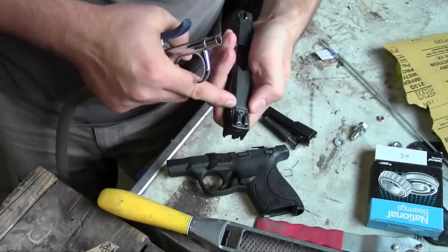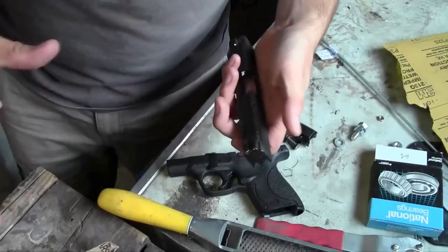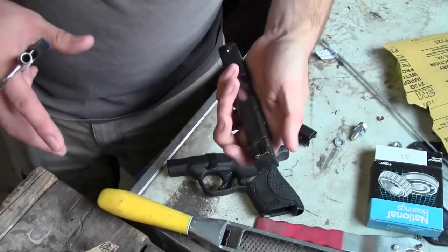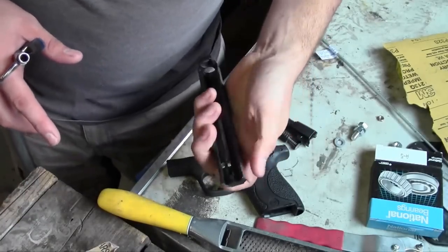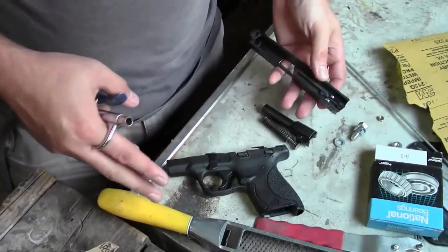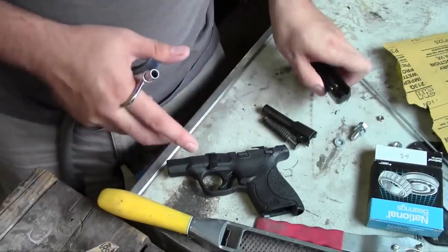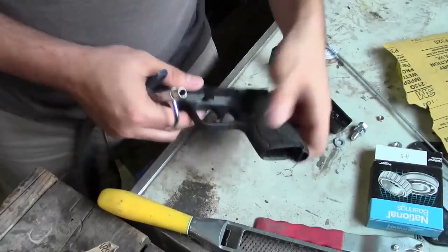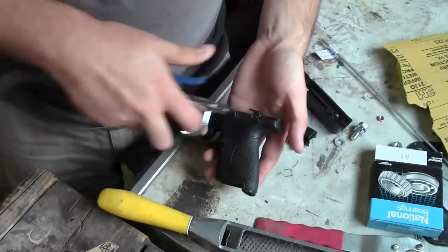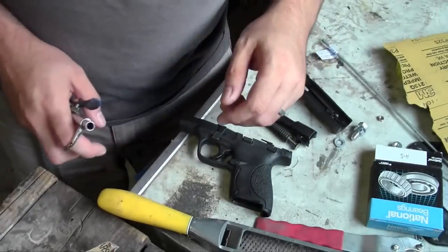If there's a crack, a crevice, or a seam anywhere in any of these parts, blow air into it, the water will come out. And when the water comes out at high speed, it takes dirt with it. And since you just put soap water in here, all of these parts are super duper clean. They are oil free, dirt free, dust free. They're clean. All right, they're gunpowder free. Now you just need to get them water free with your air compressor, which really doesn't take much at all. Just a little bit of air pressure and you're good to go.